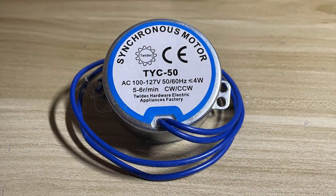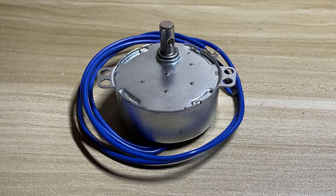I would like to talk to you for just a moment about this motor. You will notice that it has a metal case and a pair of wires going into it. The thing we need to check is that there is no electrical leakage between the wires coming into the case and the case of the motor. If there is any leakage, it will not be safe for use outdoors. In fact, I wouldn't use it at all.